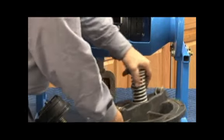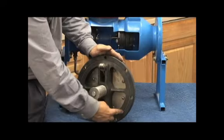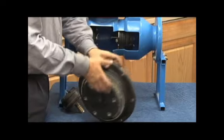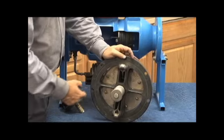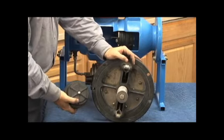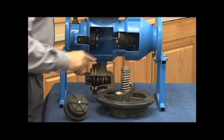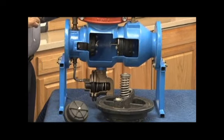When you get into the large sizes, 8-10 inch style, the checks aren't held in by a clip but are bolted into the flange, like into the body like that. Same mechanism, you remove the bolts off the back, take the cover, change the check disc. You do not have to release the spring tension even on the 10 and 12 inch checks like this one. So I just wanted to show you the larger ones are bolted in. Smaller one has one nut that holds the disc into the disc holder, but the check mechanisms are basically the same type of construction. Bolted in, held in by clips, single bolt or four bolts. That's the check mechanisms that you're going to come across.